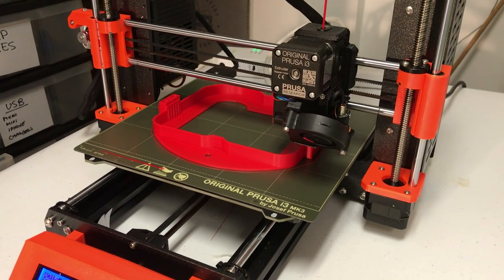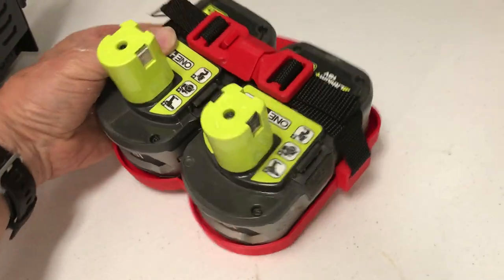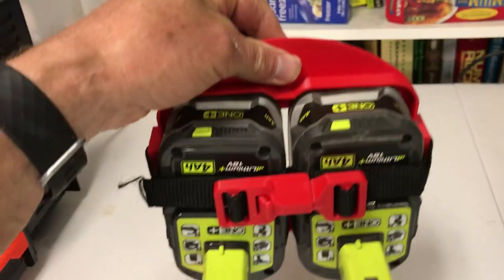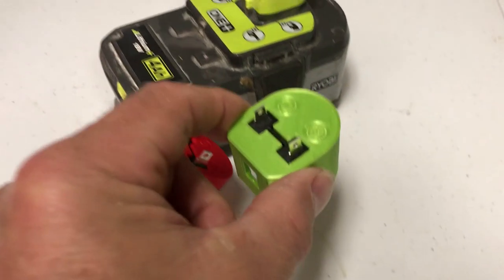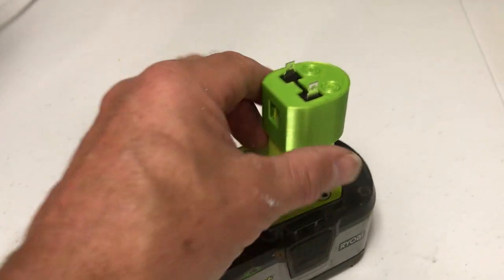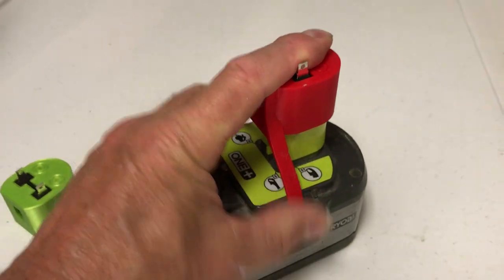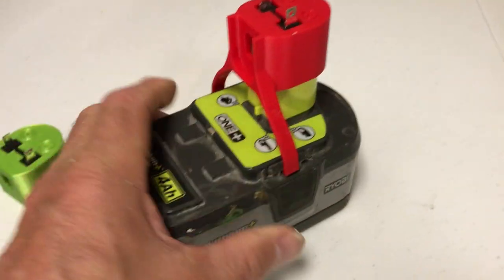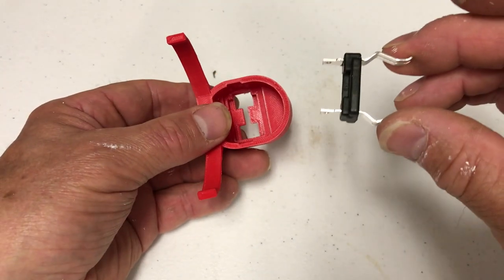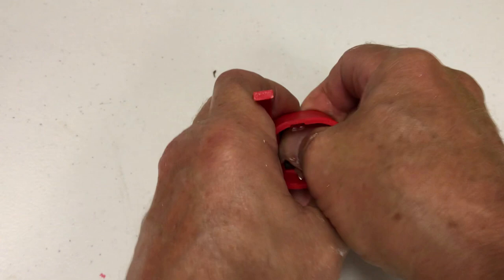Here's the little carrier I made to keep the two batteries together — it has a strap that goes around. I found this clip on Thingiverse and put a hole in it so you could hang it if you wanted. My original design to connect to the Ryobi battery was this cap that uses a Ryobi part and connects to normal connectors. For this project I added arms onto the part so that when you put it onto the battery they lock in and won't pull off — you have to squeeze the buttons to release. I've used the Ryobi replacement part; it's keyed on the end so you just slip it in and push, and it snaps into place.